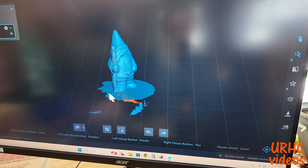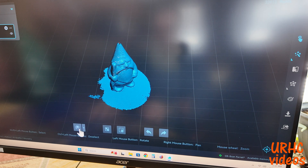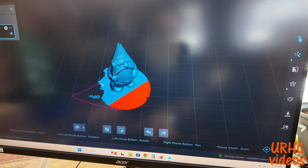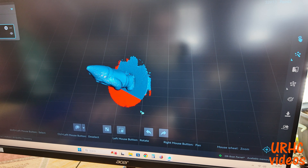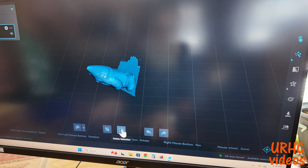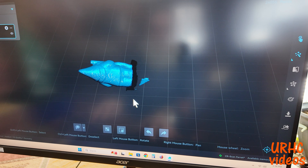Do the initial processing — that goes really quick — and there's the model. Same thing with the cleanup: you really have to clean it up. Even though it's not supposed to show the turntable, I still get a little bit, so I'm going to show you how to go in and clean most of it up. That lasso tool — I keep going the wrong way; if you go one way you can set points, and the other way it follows a straight line.